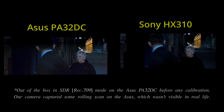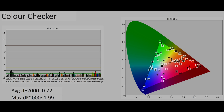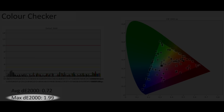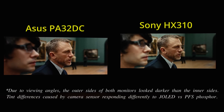These out-of-the-box inaccuracies can be rectified using professional calibration software such as Calman or Colorspace, which are able to write color parameters directly into the display, allowing us to achieve very accurate colors — with an average delta error of below 1 on this challenging ColorChecker SG chart where 140 patches were measured, and no inaccuracy exceeding delta error 2 — translating to an extremely close match in SDR terms to a Sony BVM HX310, costing nearly 10 times the price.